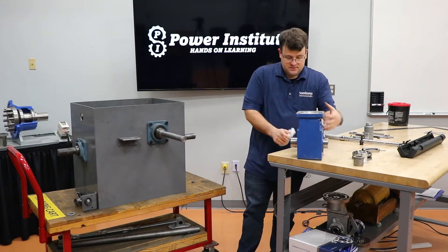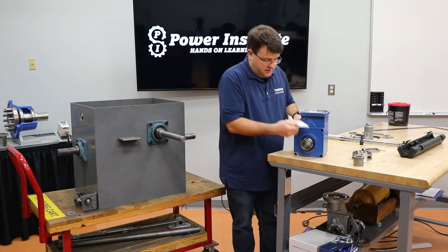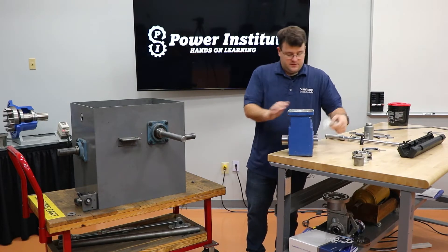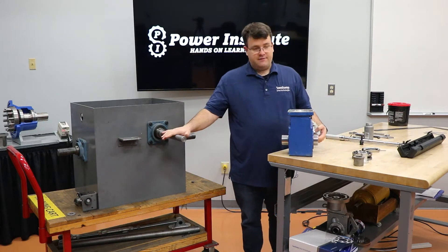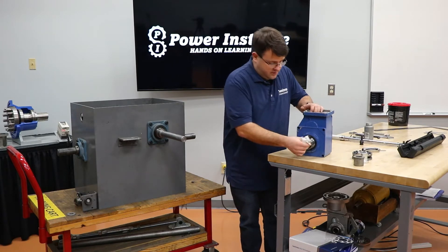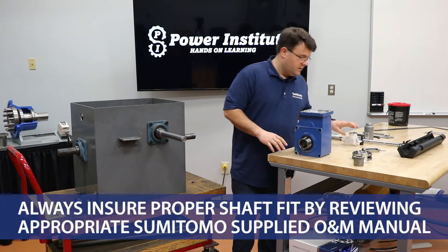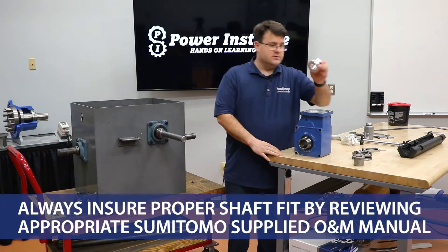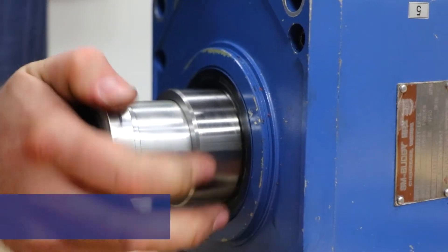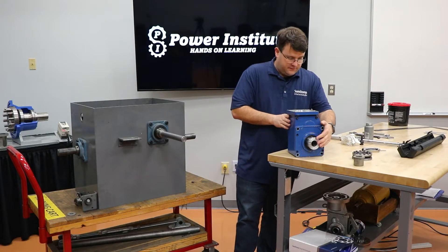You can see there are two extensions — the larger one is for the shrink disc. We'll make sure that's good and clean, doing the same on the back, on the outside as well as the inside. The bore as well as the shaft needs to be clean and dry for this application to work. So we'll go through and make sure that's good and clean. We know we're good and clean, so we can start the assembly. First up, we'll take our inner support bushing and just slide it right in here, all the way in until it's flush. That's all we have to do for the rear.